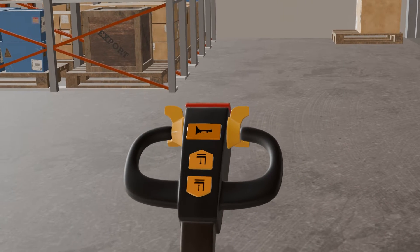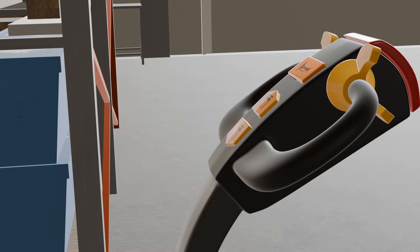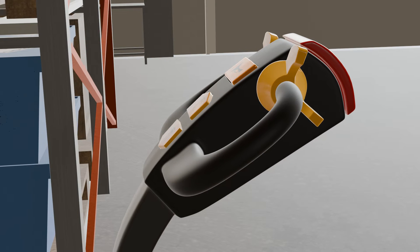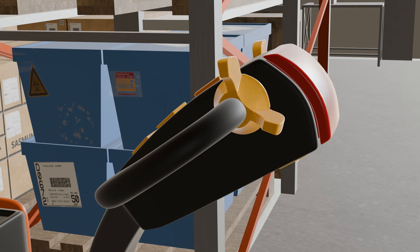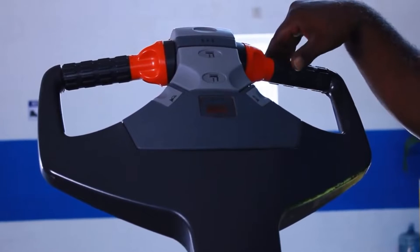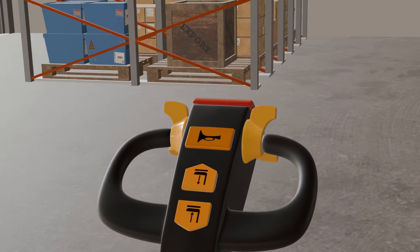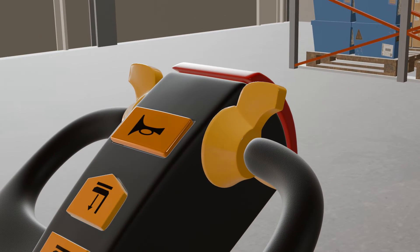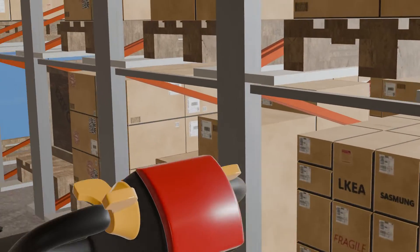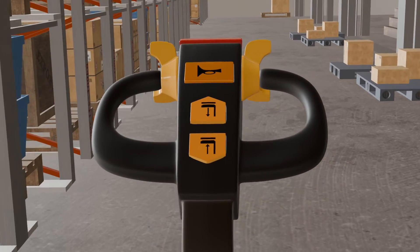The third button at the front of the control handle is the speed control button. These buttons are located on either side of the handle, near the top. Speed control buttons offer variable speed options for both forward and reverse motions. Depending on the model, these buttons can vary in design, with some models featuring rotary knobs or butterfly thumbs, providing an intuitive and ergonomic way to control the speed. Pressing the forward button will move your electric pallet jack forward, and pressing the reverse button will move it backward.